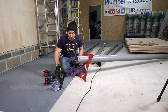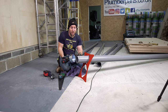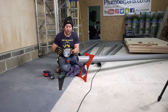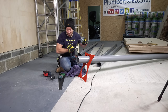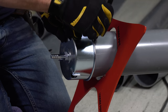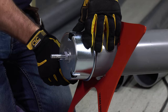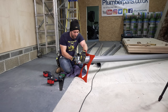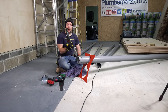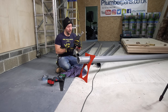The next thing - we've got the pipe chamfer here. It's quite a handy thing to use. If you're only going to cut a small bit off, you can actually use the pipe chamfer as a marking guide - just take it off your drill, pop it over the pipe, get yourself a felt tip, mark round it, make sure it's nice and square, and use that as a mark to get a cut. I usually use an oscillating tool - you can use a hacksaw, but these are quicker and do a nice cut.